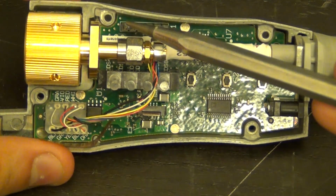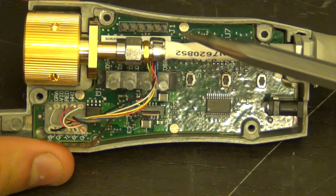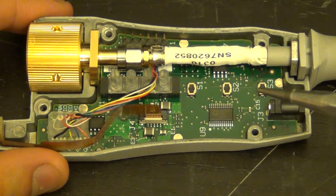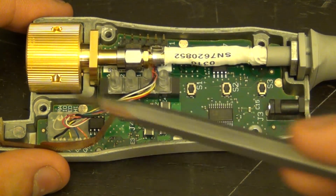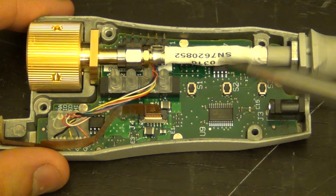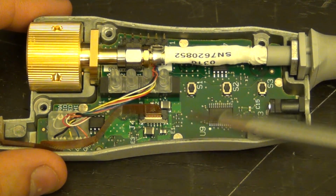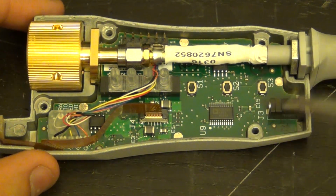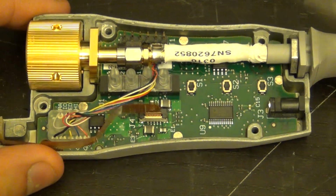And I can see a bunch of connectors in here, most likely to download calibration coefficients for this specific probe, because these are individually measured for frequency response and corrected for, and I think that's all stored in here, so that when you plug it into the scope it will download this, because there's no way to get 25 gigahertz flat bandwidth over all the different dies, especially from a 3.5 technology, and they correct for that to give you the proper amplitude flatness that you're looking for.